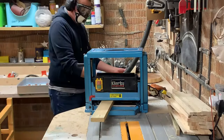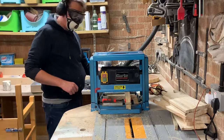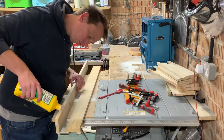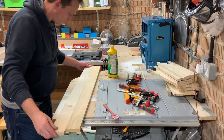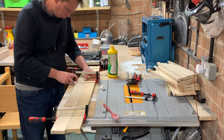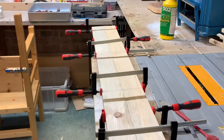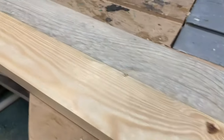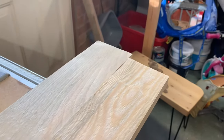So now I'm going to change my approach. Taking two simple pieces, I'm going to glue them together. First of all it's onto the planer to try to get them squared all round. I'm happy with how this has come out — it's nice and square — so it's on to adding some glue and getting the pieces clamped up so I've got a nice big surface area to work with. And there we go, now it's the next day. It's not a bad join — it just needs another time or two back through the thicknesser just to make sure everything's nice and uniform and neat.